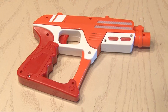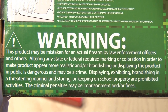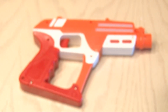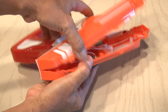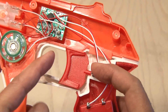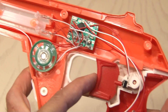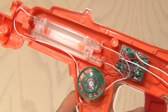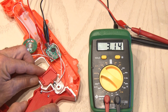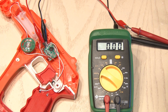Now onto the Shadow Pulse Blaster. Don't forget to read the very important warning on this toy gun — times sure have changed. After removing all of the screws, we're going to pry this gun apart and separate it into its two halves. It's a pretty basic setup inside with a trigger and a small momentary switch that goes to a circuit board, with a little speaker and lights. Now we need to find two spots on this circuit board where we'll have power when we press the trigger and hold it down, and we've located those contacts.